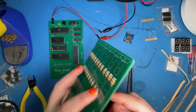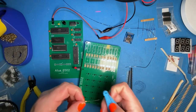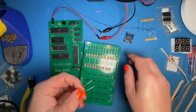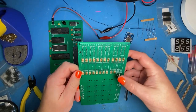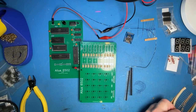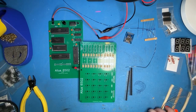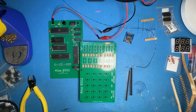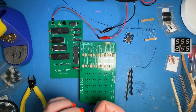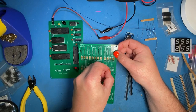We'll have a quick look through the code before we build it. It's 100% hand-rolled 6502 assembler, and I've never really been an expert in 6502 assembler so there are probably efficiencies to be had, but it works. It fits the philosophy of the machine — observable and understandable. It'll load a 4k file in about one second, which anyone who's used a datasette or an unmodified 1541 could never complain about. The entire ROM with FAT32, display update routines, interrupt handlers, and keypad reading routines weighs in at about two and a half kilobytes — and it's a 32k ROM chip, so there's heaps of headroom. I'm thinking of adding fixed-point or floating-point math routines, because in 6502 land all you get from a math perspective is add and subtract — even a basic multiply doesn't exist unless you roll your own.